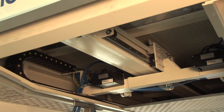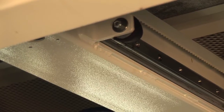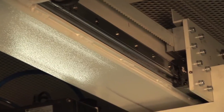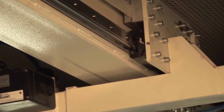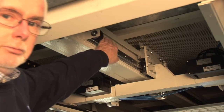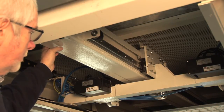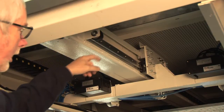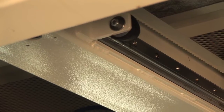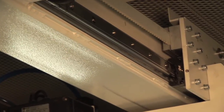Another unique feature of the Superfici range of spray machines is that we do not use a standard extruded aluminum reciprocator mechanism which is typically bought from third-party vendors. Within our group, we have manufacturers of CNC routers. They have designed for us a linear bearing system mounted on the beam the same as a CNC router. So this mechanism is extremely rugged — it is designed to take far heavier loads than ever can be put on a spray machine. This is a very reliable feature of the machine and it's also an item that gives very good precision when spraying.